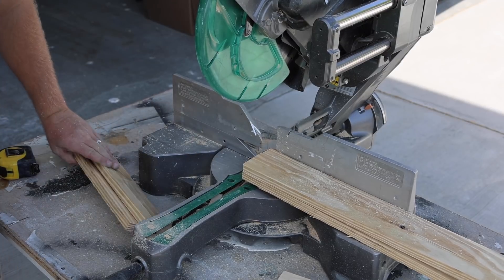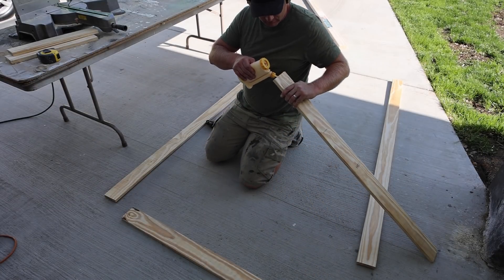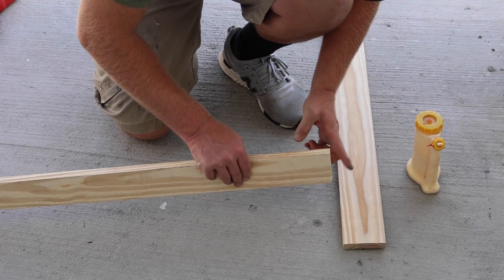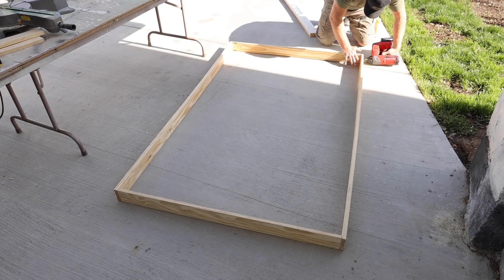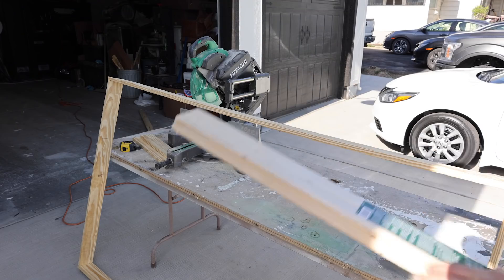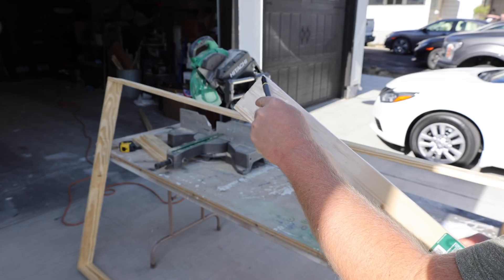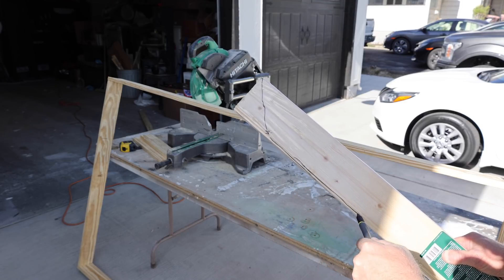This frame is pretty big, so I'm just going to lay it out right here on the concrete and nail it up. I'm using my 15-gauge nailer. If you don't have a nailer like this, you could easily use regular nails and a hammer. You could also screw it together — if you do that, use a pilot hole so you don't split your wood. We've got our frame here. Now we're going to add a little bit of strength because right now it wants to bow and sag since it's 78 inches long. When I cut the bead board, I want the inside of the miter cut to line up with the actual measurement of the TV.